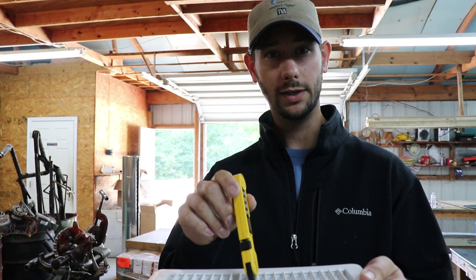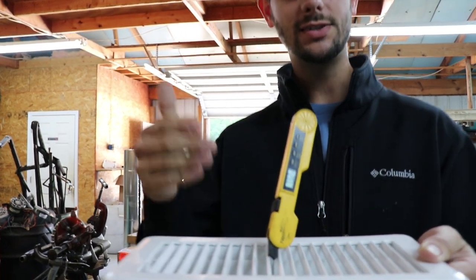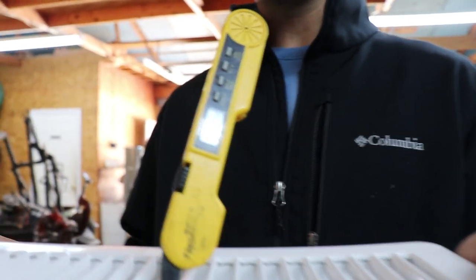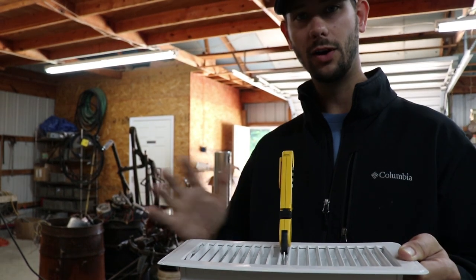After you've turned your unit on cooling and let it run for 15 minutes, you're going to come check and see what the temperature is. If the room thermostat reads 73 degrees, the supply register should be at 53 degrees — or within 1-2 degrees of that.